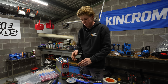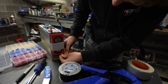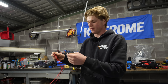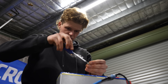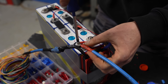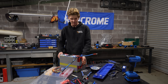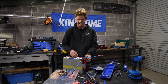When it comes to the balance wires on the plug, you have to be very careful which wire you connect to which cell. Looking at the plug, the first black wire is your negative wire, and then you count from the black wire across to know which wire goes to which cell. The first wire closest to the black is the positive for cell one, and then it goes cell two, three, and four from there. That should be a working lithium battery — all connected, all balancing wires done, main positive and negative ready to connect to the case terminals.